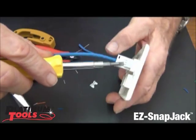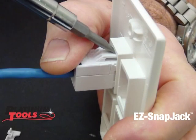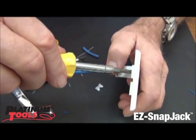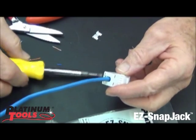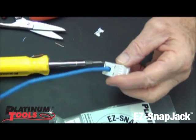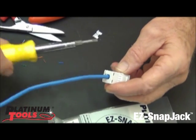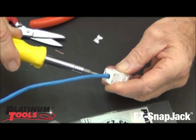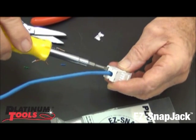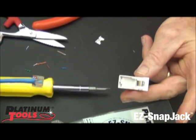If you have to take these out, go in here like that, put a little bit of pressure down here so when I release it I can feel it — right there. Open up the jack because you can reuse them. Let's say your cable's too long and you wanted to take a foot off and make it shorter — just take your screwdriver, put it in the little tab, and sort of twist it to pop it open like that. Now you can start over.